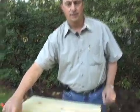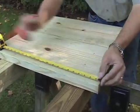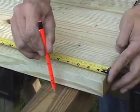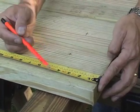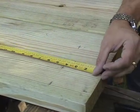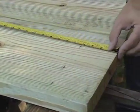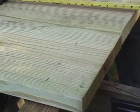Now we have to drill 4 holes in each 2-foot section of the 2x12 in order to hold this to the 4x4 uprights. Four inches from the edge puts us dead center on the 4x4 post. We want to break this into thirds because this is 12 inches wide — so we go 4, 8, 12 inches. We're going to take 4 inches from the bottom and 4 inches from the side, and then on the other end 8 inches and 4 inches, so it perfectly centers the lag bolts. We're going to do that on all 4 spots.